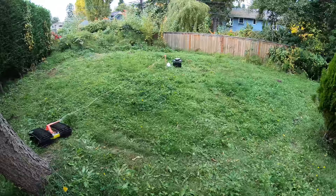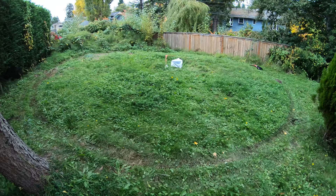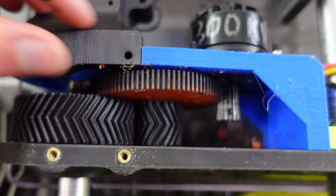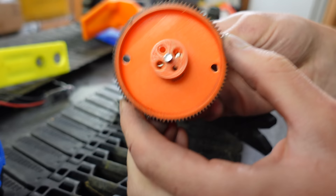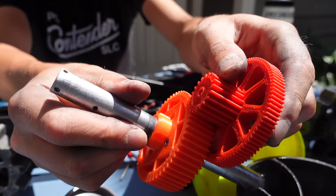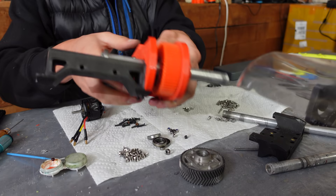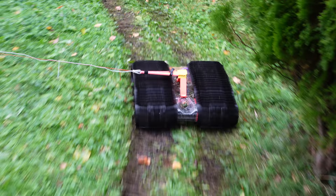You can see how over time the vegetation starts to wear in and a clear track emerges where this thing has been driving. After a few days of driving with these 3D printed gears, to my surprise the first thing to fail was not the gear teeth themselves, but actually the center of the gear. That's probably because this design was meant to be CNC machined in steel and not 3D printed. So then I replaced both of these with the new potential injection-moldable candidate — still 3D printed out of PLA, but with the same design that I would end up injection molding — with flat teeth this time, no herringbones. You can't injection mold herringbone gears because the mold wouldn't be able to pull out.